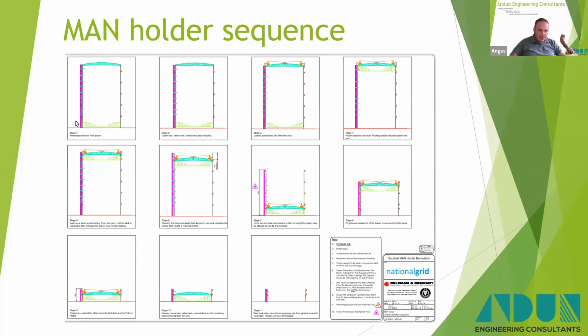So within a man gas holder, you have a piston at the bottom. Gas used to be pumped in at low pressure underneath that. That lifted the piston, and the piston then provided the downward force to push the gas out into the gas mains when we use low pressure gas mains.